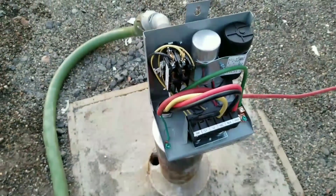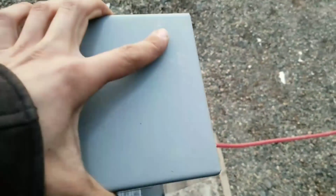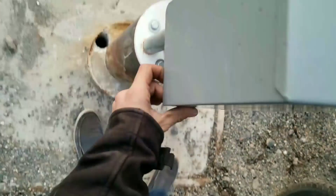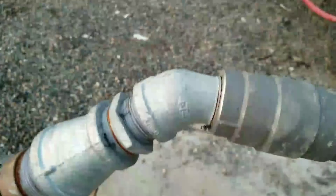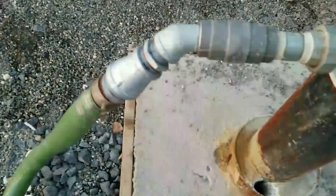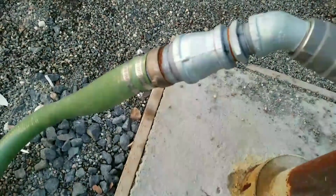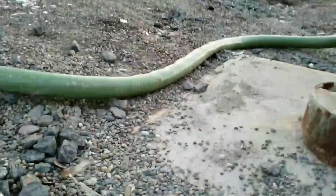I'm not using that contactor because I don't have a pressure switch — it's just open on the end. The water comes out through inch-and-a-quarter pipe, goes through a union, then a check valve, then a 45, and then is enlarged to two inch. It then goes through this green hose that's two inch, which we got from Harbor Freight Tools. This isn't the best hose because if you leave it in the sun, it'll actually flatten out.